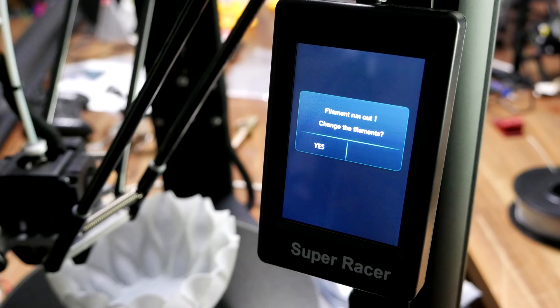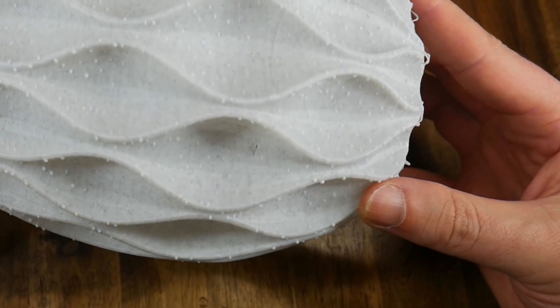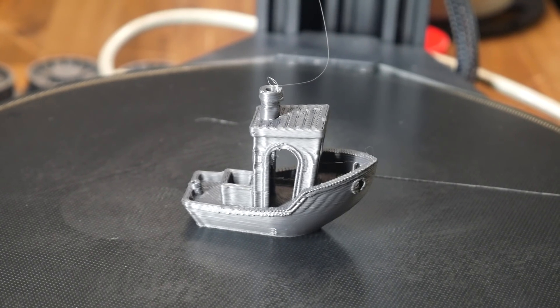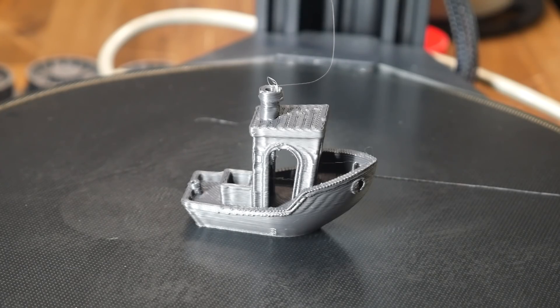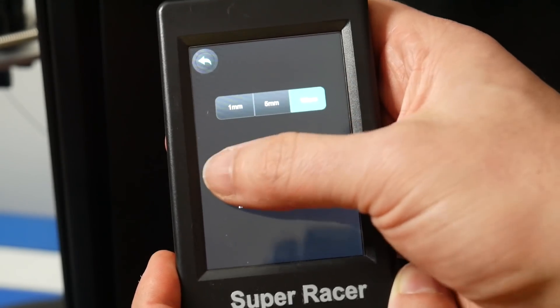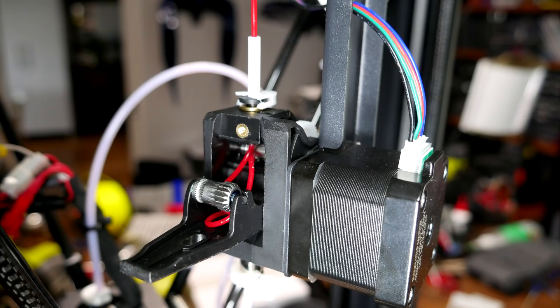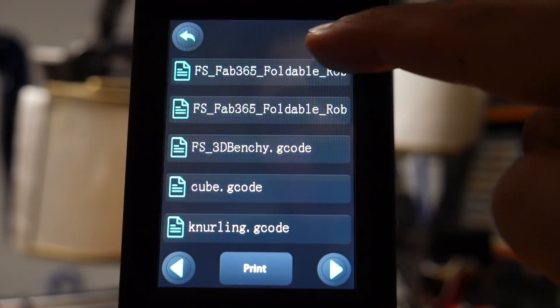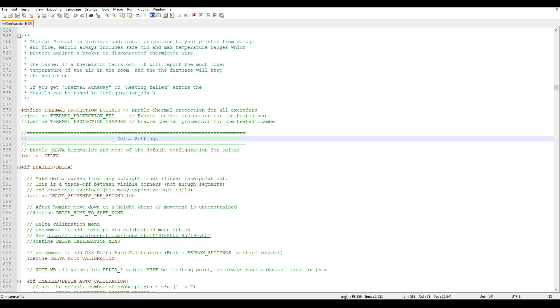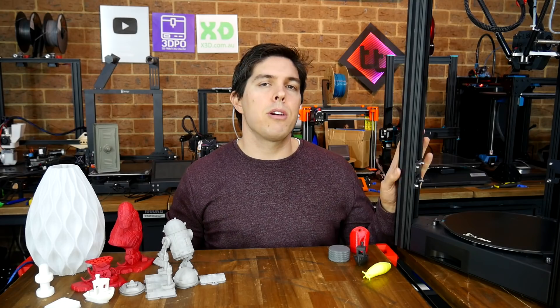I tested filament run-out protection while printing the vase, which worked quite well, leaving quite a minimal mark where it resumed. I also tested the power-out protection, stopping one of my speed benchies partway through. The machine heated up, homed at the top, and then came down and resumed without any issues — just keep in mind that if you wait too long to restart, the bed will cool down and the part will likely come free by itself. One issue I have is that I find the LCD interface a little too simplistic — the manual extrusion has no speed controls, with the default speed being too fast to load in TPU. It's also worth noting that you need to keep filenames short as they get cut off on the narrow screen. One thing I was really happy about is that the machine uses Marlin firmware and they've actually honoured the license with the source available for download on their website. I did notice that thermal runaway protection was enabled for the hot end but not for the bed.